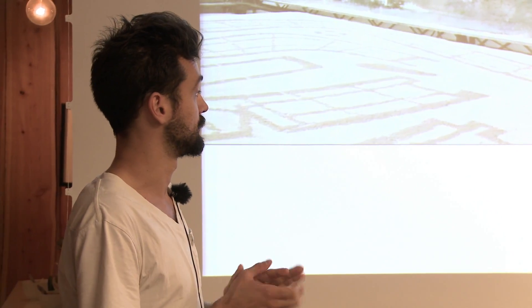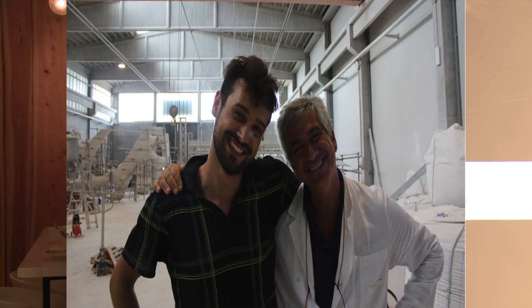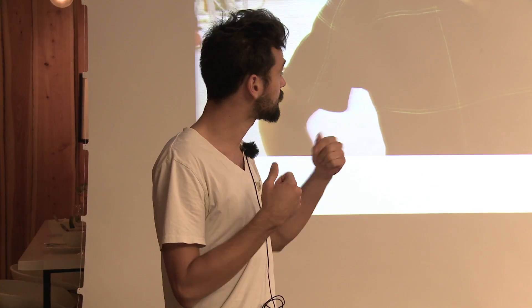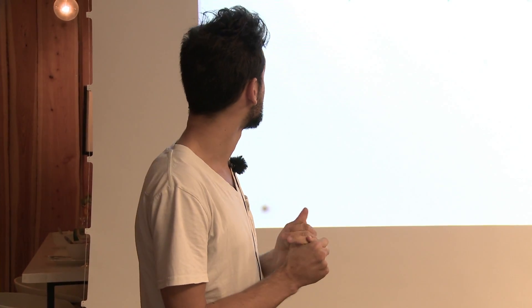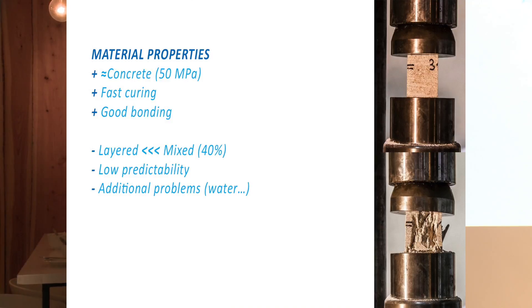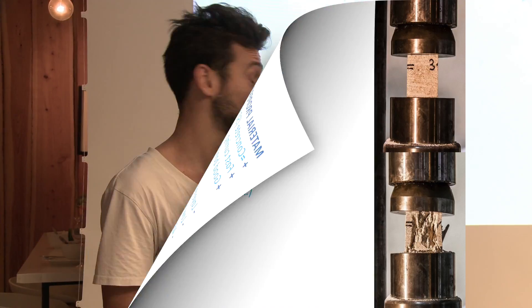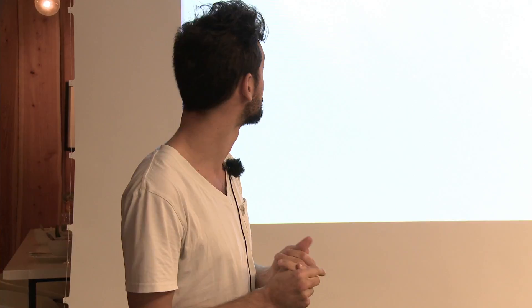How do I come into this picture? Basically I met the guy who invented this during my master thesis. I went to work with him for a couple of weeks, we did some printing together, and on the way back home I took some material and tested it for him. It turned out the material was quite good — very similar to Portland concrete strength-wise, fast curing, with really good bonding properties. It could bond with pretty much anything: wood strands, you name it.